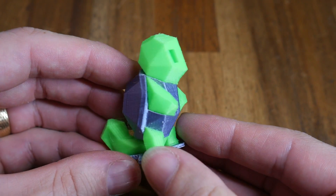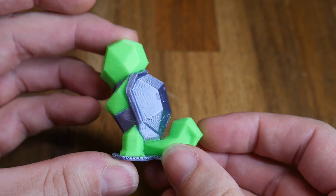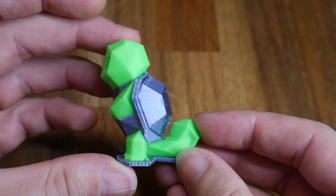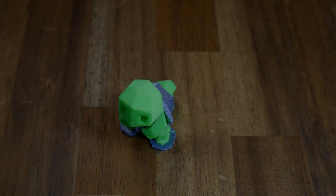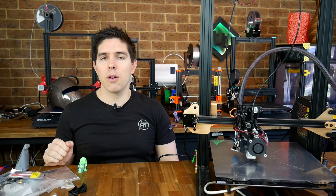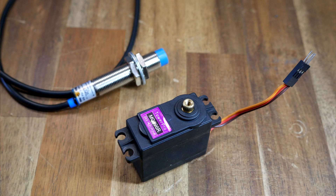The surface artifacts are from the ancient A4988 stepper motor drivers, so I might modify those next. But in terms of the dual extrusion, this model is very clean and I didn't even need a purge block. It's satisfying to finally get this working, but I'd be lying if I didn't admit it was a nightmare at times. Apart from the broken servo and ABL sensor, I'm still a fan of this kit.